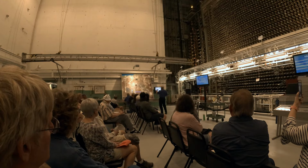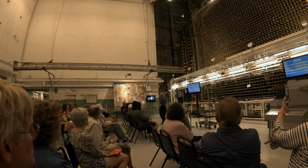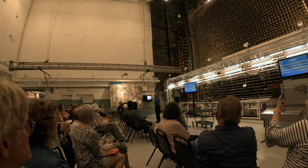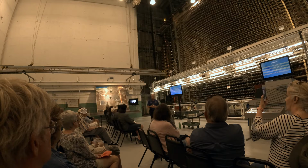And then it came into the 190 pumping building where the pressure was raised to bring the water in under the floor, up through those cross headers into the 2004 process tubes. So it pumped it into the building that you are sitting in, the 105B building. And notice when the water leaves the reactor, we change the color because it's now extremely hot. And it goes out to a settling basin where it was allowed to thermally cool for a period of time before it was discharged back to the river.